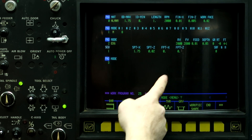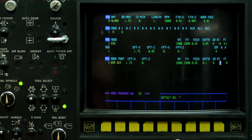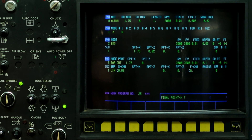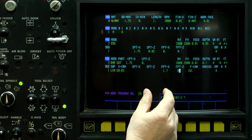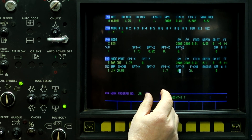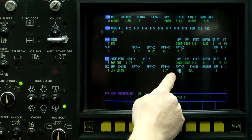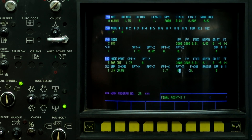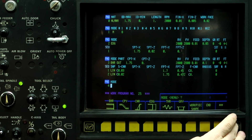The next thing I'm going to do is turn the diameter. So bar out, 1.75, auto. And I'm going to delete the roughing tool and just have a finish tool — tool 4, offset 1. So linear, 0.030, 1.7. And I'm going to make these parts 300,000ths long, plus the cutoff tool is 125, so that would be 425. And I want to turn it back a little farther so that the radius of the cutoff tool isn't into the end of my part, so I'm going to go somewhere around 0.450. Down arrow, linear, 20,000ths chamfer, and then 0.450, 0.472. And figure check — store scale. So I'm facing it off, turning the diameter, and then chamfering the bar.